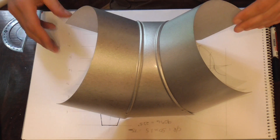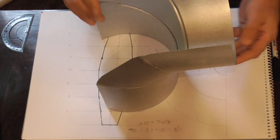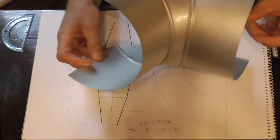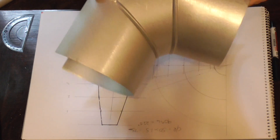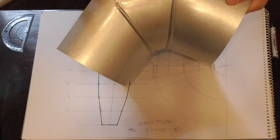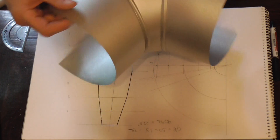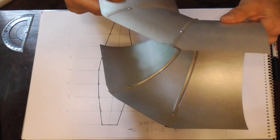This is the throat. As you can see, it's 90 degrees. It's made in three parts: we have a starter, a segment, and a finisher, and it is fastened on both sides with rivets. It's got a number two swage — as you can see, it's very strong.